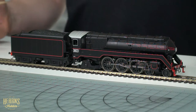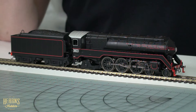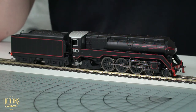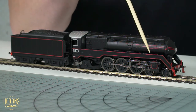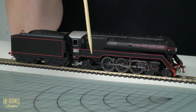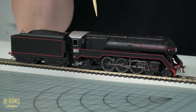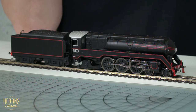The C38 was a very successful Australian steam locomotive designed specifically for passenger service. It is what they would call a Pacific class steam locomotive, and that has to do with the wheel arrangement which was very common for steam locomotives in Australia, the US, and even the UK. That basically refers to a 4-6-2 wheel arrangement: four pilot wheels, six driving wheels, and two trailing wheels. That particular wheel arrangement is known as Pacific, and this arrangement was particularly efficient for steam locomotives designed for passenger service.